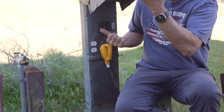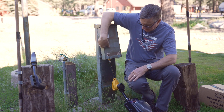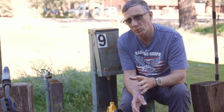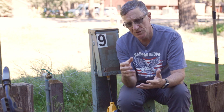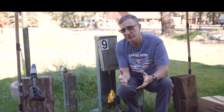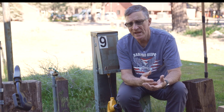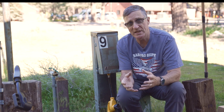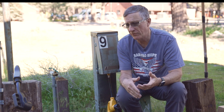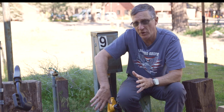In the super common setup with one 30 amp service, you'd run your 30 amp to 50 amp dog bone, which sends two legs of service into your coach at 30 amps. Thirty amps supplies roughly 3,600 watts — voltage times amperage, so 30 times 120 equals 3,600 watts. A hair dryer can be up to 1,500 watts; coffee makers, toasters, anything with a heating coil runs 1,000 to 1,500 watts. Add a microwave at 900 to 1,500 watts, and you're out of power right away on a 30 amp service.